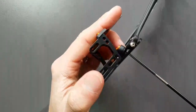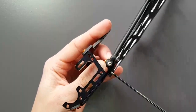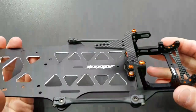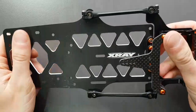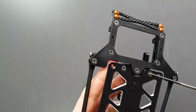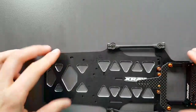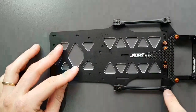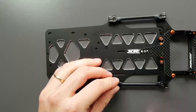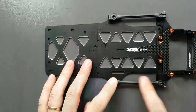This is why the pivot has slots in it for the nuts to slide, so that you are able to find the correct position. Free movement is very important. Keep searching for the side links. It's important to have a little opposition - having no play and no movement means binding most of the time. So it's very important to pay attention to these things.